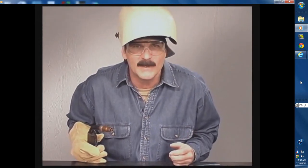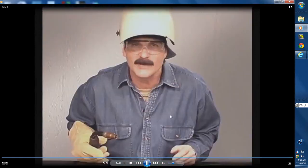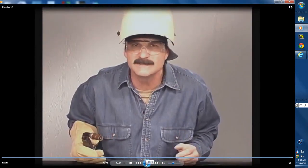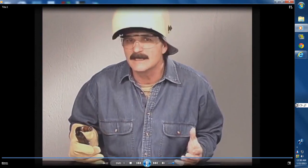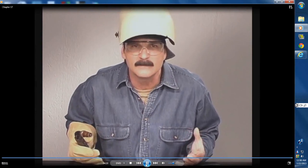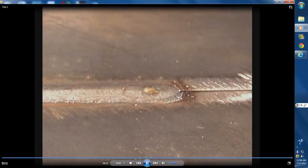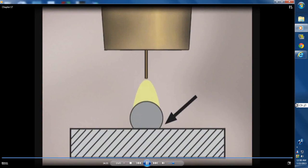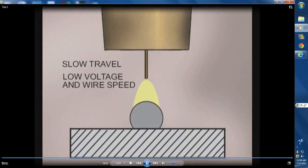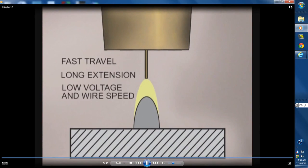Try setting up on different metal thicknesses, tune the voltage and wire speeds together, and make some practice welds. If there's too much metal and you can't stay ahead of the puddle, turn the settings down a little. Examine the finished weld bead: a smooth uniform bead will come with practice, but the edges should be fused to the base metal. If edges are rolled over, travel speed may be too slow with voltage and wire speed set too low. If the weld bead stacks up not flowing out on the side, you might be traveling too fast, using too long an electrode extension, or voltage and wire speed are set too low. Excessive weld spatter means voltage is probably too high for the wire speed.